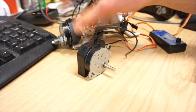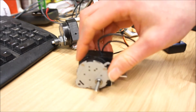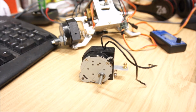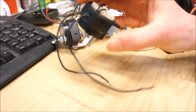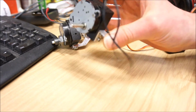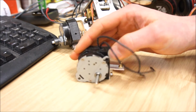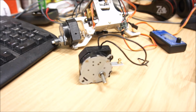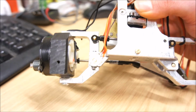You need to make it a bit thicker than you would with aluminium, and if you're hardcore, if you're building models that are really heavy duty, then that is probably not for you. But then you will probably have a milling machine, and you can do something similar in aluminium. If you just have a pillar drill, like I have, then the Forstner drill plus thick plastic is, I think, a very good alternative. Okay, two things I forgot to say.